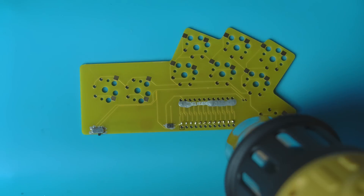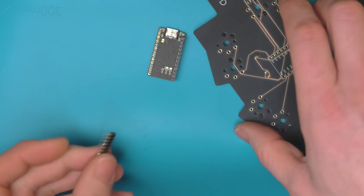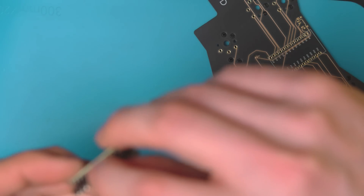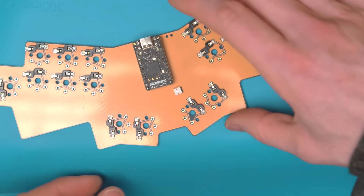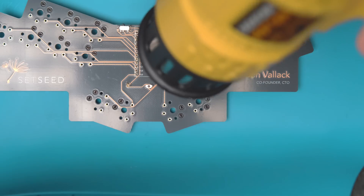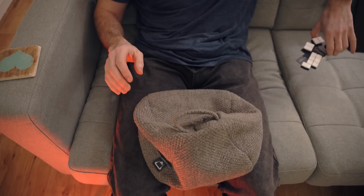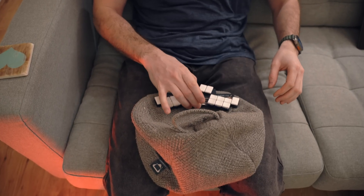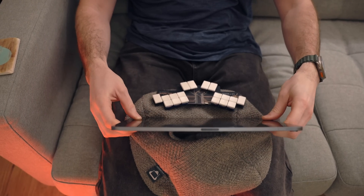When I was designing this unibody version, I obviously don't need the reversible footprint. So I changed it to the normal one, but I forgot to check which way round the footprint would work. In this case it would mean I'd have to flip my nice nano controller over, but I didn't want to desolder all the pins and do that. So I actually stuck the nice nano controller on the underside of the board, which is pretty strange — it's obviously not level at all — but because I'm using it on a beanbag it doesn't actually matter. It just sort of sits into the beanbag.